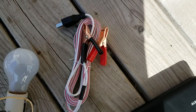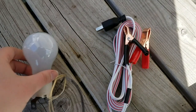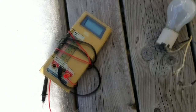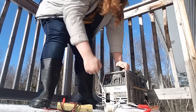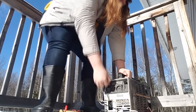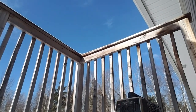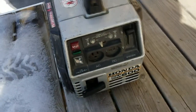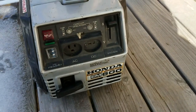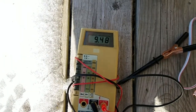It's now about a month later after I filmed all that. I bought a proper Honda generator DC cable on Amazon — just a generic thing from China, but it fits pretty much every Honda generator since the mid-80s — and we're finally going to see how the DC output works. This thing does run really, really well, especially for having been stored for half a decade with old gas in it. I'm noticing on idle it's got a little bit of a miss. My guess is it doesn't like how slowly the choke is opening, so I might play around with that and adjust it to open a bit faster.